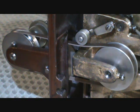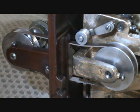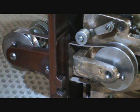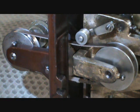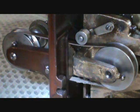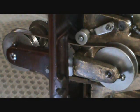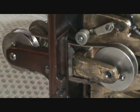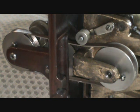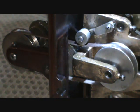Here is the mechanism showing it running from top to bottom. The belts on these mechanisms are usually tapered on both ends when you're attaching them, and the best way to attach them is with contact cement — put a little dab on each side of the belt, roughing up each end before you put the glue on. Once the glue is set, loop the belt around both pulleys and try to attach it onto either the top or the bottom pulley, make it nice and tight, and hold it there for a few seconds until the glue is set. That way you get a nice tight grip on the belt. Here is the splice.